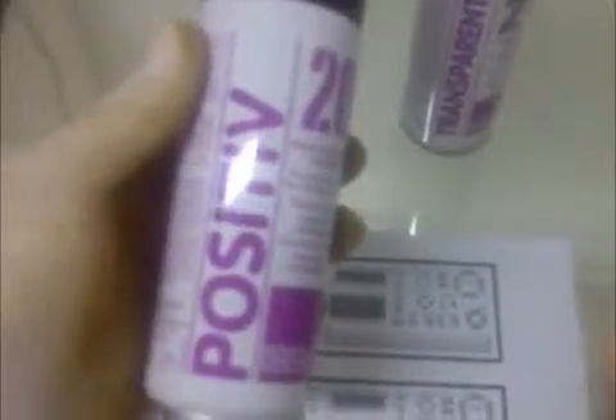We've got our positive white paper sheet — this is not photo paper in any way whatsoever, just normal plain white paper, laser printer. Very important: not inkjet, laser printer. I've got my two cutouts here. Our photo resist — this one is called Positive 20. There are different kinds. Here's our transparent spray, which we will be spraying on the paper to allow UV light to pass through to expose the board.